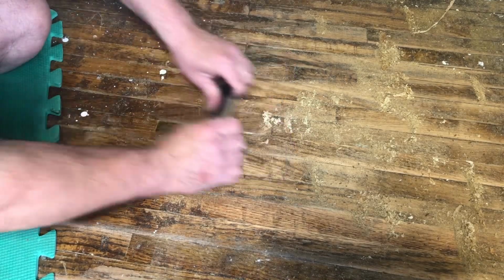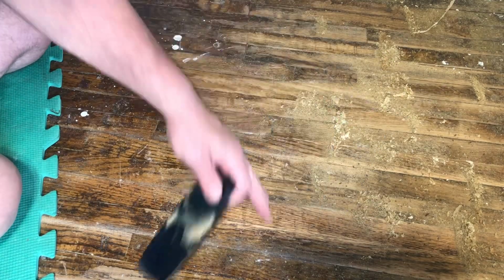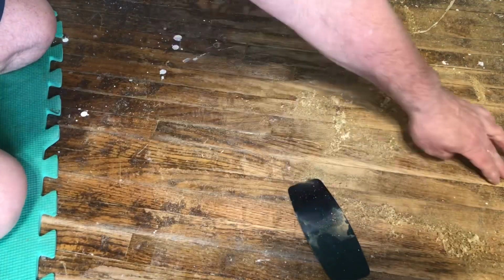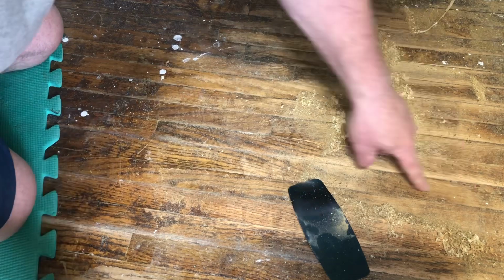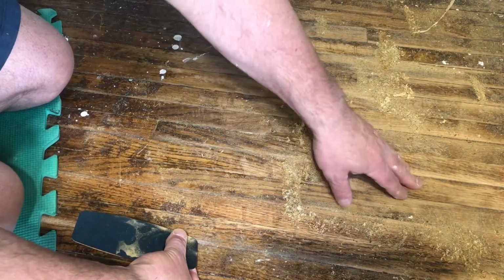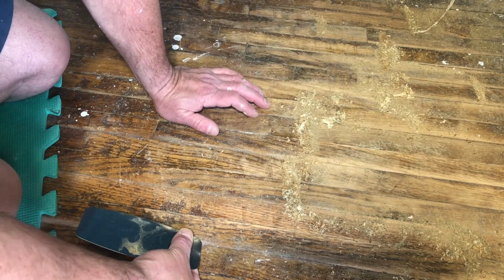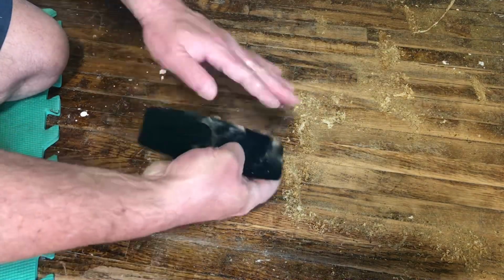So I'm going to say that that worked pretty well. What I'm going to do is mark it with the power sander, and wherever I have a high spot, where it's clear, like this right here, you can see where it's really hitting the wood, but this is barely getting touched. It's still in frame. So what I would do is take the card scraper and just go in there, knock that back, do a little bit of detail sanding, but that's more than enough, I think, to put another stain down or a whitewash, and then do a lightly painted floor to really contrast what's going on in the rest of the room and give it a little more brightness.